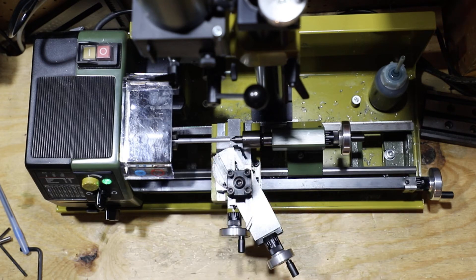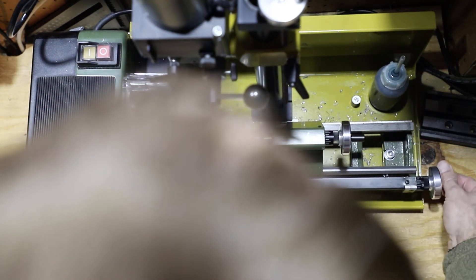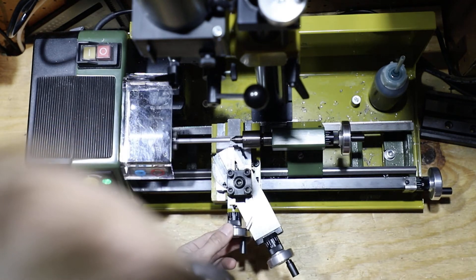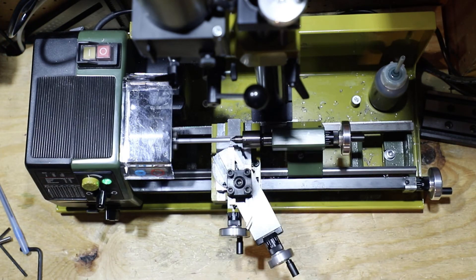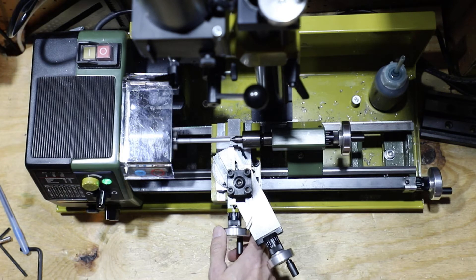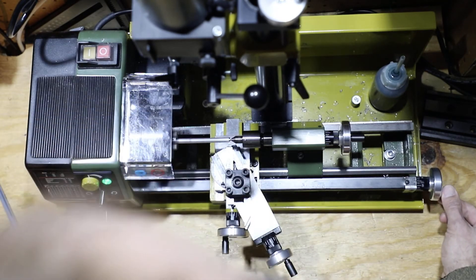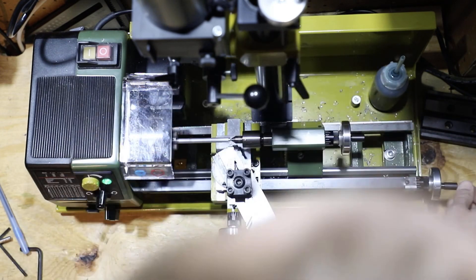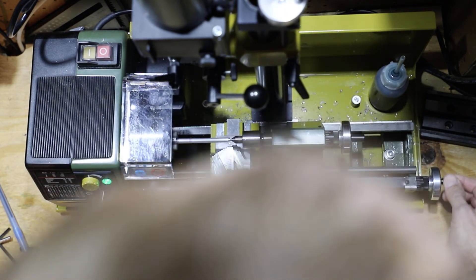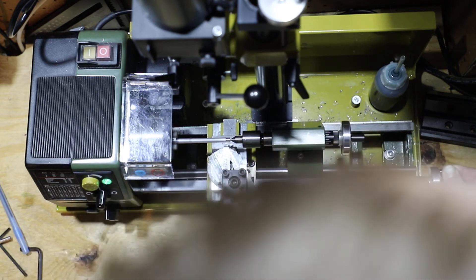The first thing we want to do is translate and shave off 6.5 millimeters right at the start. We're working from a 6.3 millimeter diameter and want to get down to 4.8, so we need to shave off about 1.5 millimeters total — 0.75 millimeters per side. We don't want to do all that at the start, so we're going to go two tenths first to get a really clean edge. Zeroing our translation — that's six and a half rotations — that's about as far as we want for the threaded area.